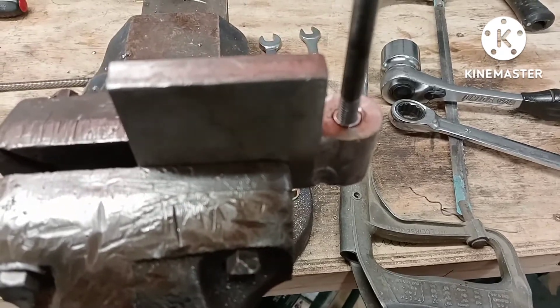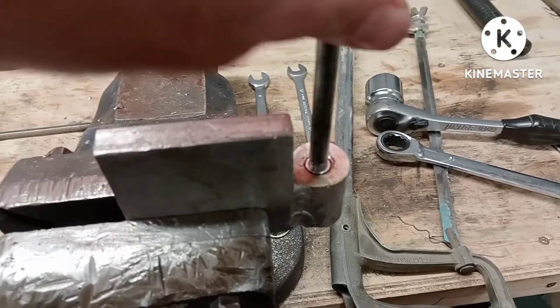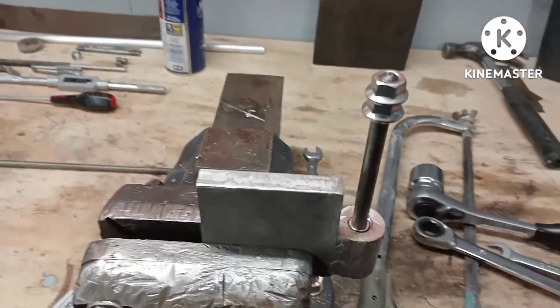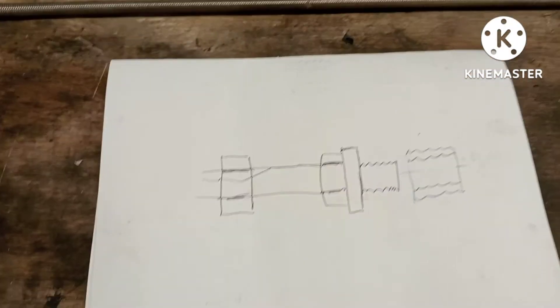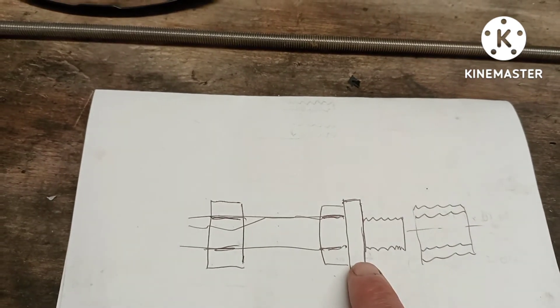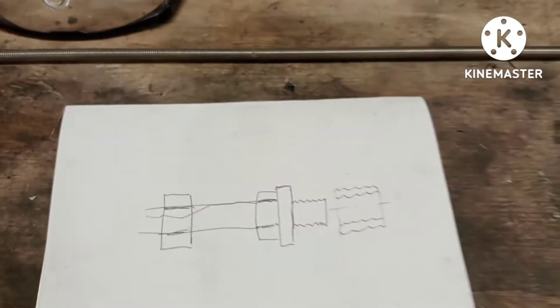What I did with the second one - when I used the die to cut the thread, I just ran a normal nut down it and it cleaned it up just enough so it's still quite a tight fit. I'm also going to make a little insertion tool - a bit of M8x1.25 rod, weld a nut to it and maybe a plate for more area, and a nut at the end so I can drive the insert in without using the stud itself.